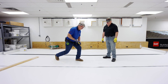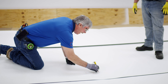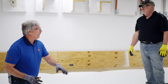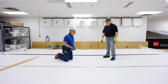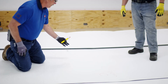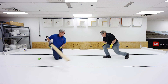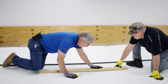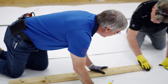So we've got an idea where our drainage is going to go. You can see right here — there's the center of our drain. If you're doing this in the field, you probably want to mark it, because how many times have you walked by and it's not marked? You feel it in your back. This is where our drain area is going to go. We're going to do a five-by-five target on this — two and a half foot off the center. We've got some thin pencil lines on here, but just to make this visible for the audience. This is going to be the outside lap.